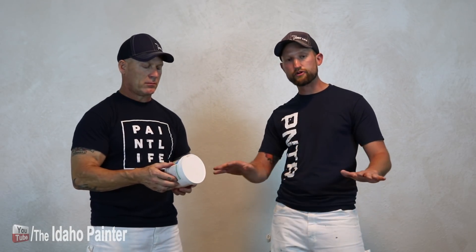So if you've got a clear grain and you're going to be putting a clear coat over the top of it, you can even use this stuff for that and it's brilliant. It was originally developed for guitars and tabletops for getting that ultra glass finish. It's a clear product, water-based, very easy to use, and it dries really quickly and sands very easily.